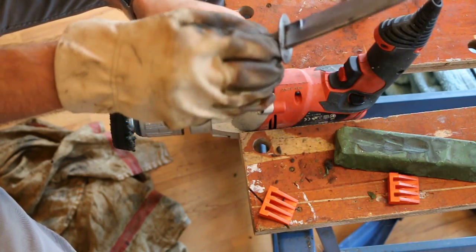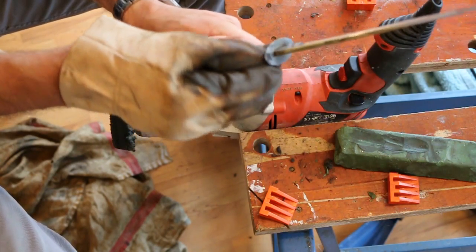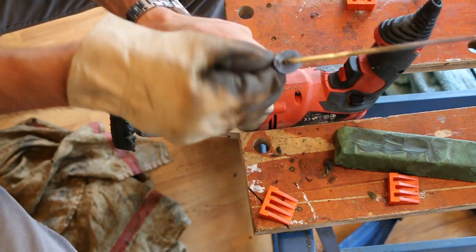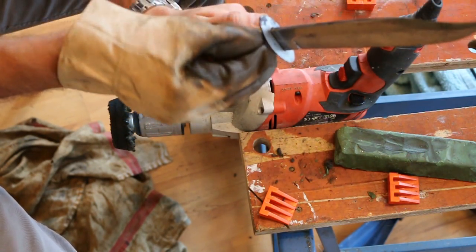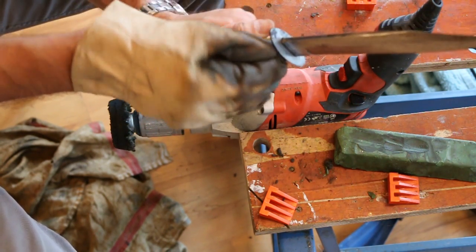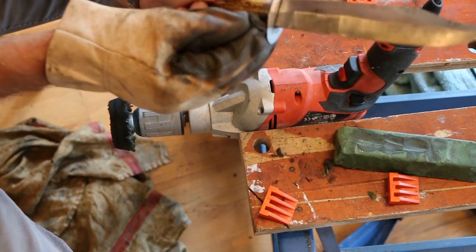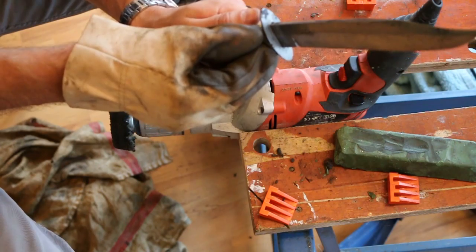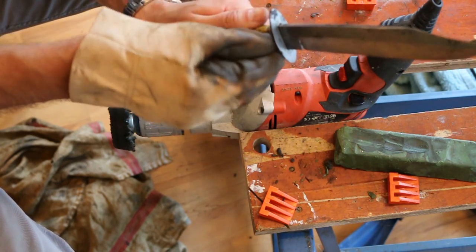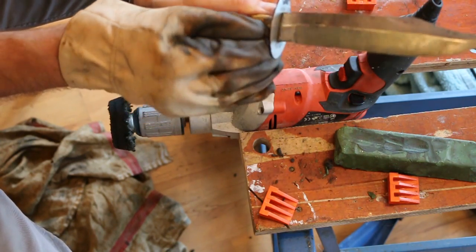It's around here. Funnily enough, the ferrule on this is very clean, but it does have that nasty varnish that we were talking about before on it. So actually what I'm mostly doing here is cleaning that varnish off. Old-fashioned varnish, as many of you will know, has a tendency to go brown with age. So sometimes when you see brown gunk, and what can even look like rust, on antique weapons, it's sometimes just varnish, and you clean it off.